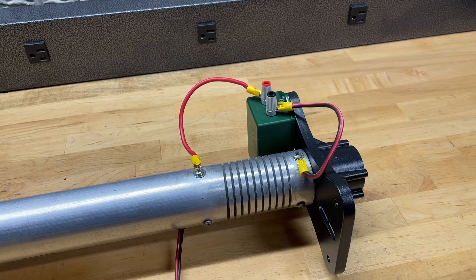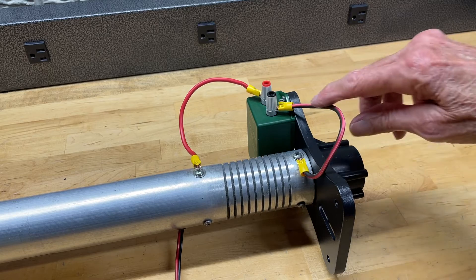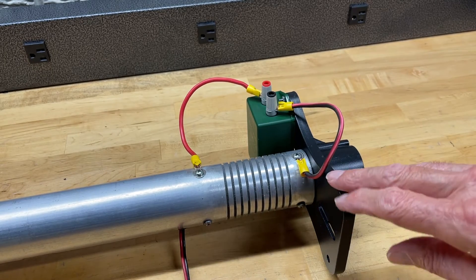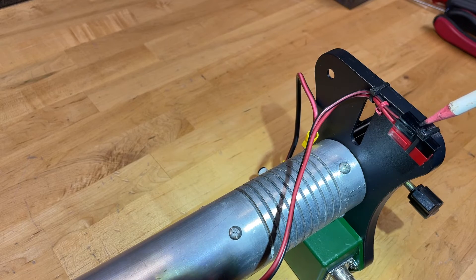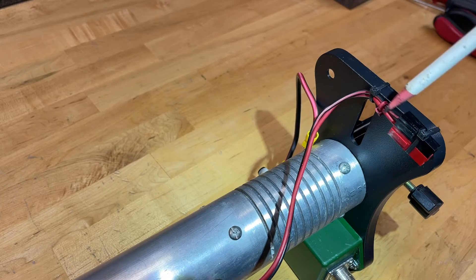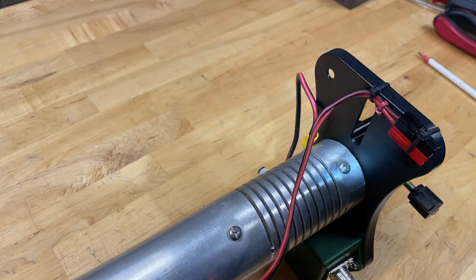There are the jumpers from the balun — I just used some crimp-on connectors with 14-gauge wire. The red one and the one with black marking, so I know that's the ground. The next thing is mounting the electric wire that's going to control the motor — the up-down on the motor. I used Anderson power poles on the end of the cable, then brought it around and used the existing holes with small zip ties to secure it, and also zip-tied to the hole back here for cable strain relief. So it just wraps around and goes into the motor section. Next is going to be mounting the box for the radials — that's going to be interesting.